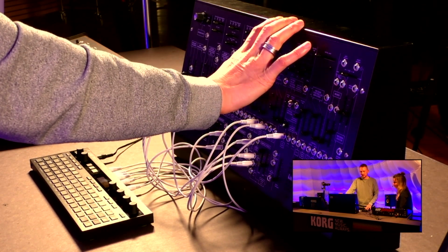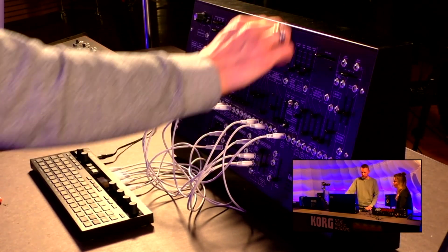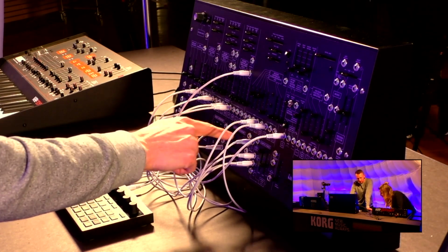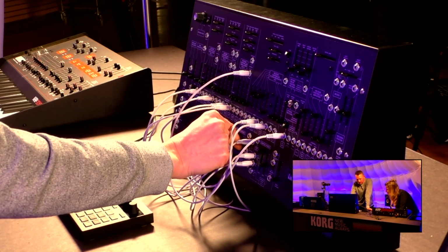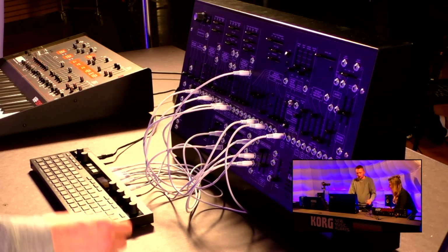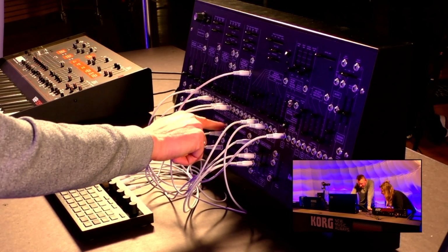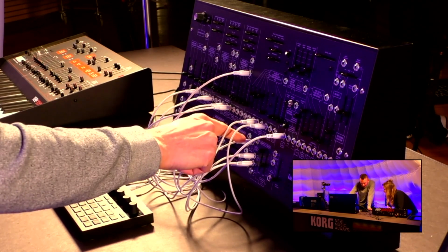So then I have these 3 voices doing their thing, and then I have a lot of ways to control it. One thing I didn't mention is one trick I really love about the voltage processors. I think it's not so well explored in a lot of patches. So what I'm actually doing here is I'm using one of the mod outputs. So I can create a value between 0 and 127, usually what you would do with a mod wheel, right? So I'm running this into this voltage processor here. And these 2 inputs are combined and then come out of this jack, the inverter.